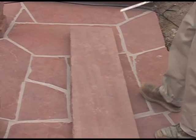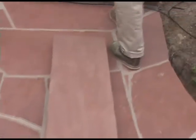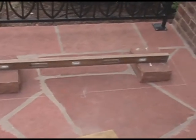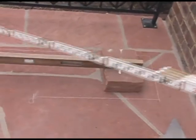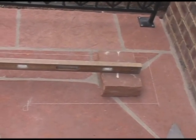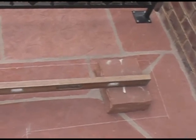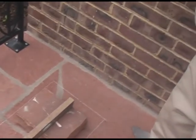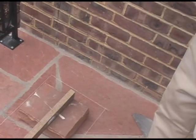And in order to get it right, what we do, we went up on this pad where it goes, and as you can see, we dry laid it out. So you suggest to the viewer that they need to put a pencil mark in so they know what it's going to look like and get the exact measurements, right? Yes. And that way too, you have an idea, like here where they wanted it this far from the wall itself and that far from the railing.